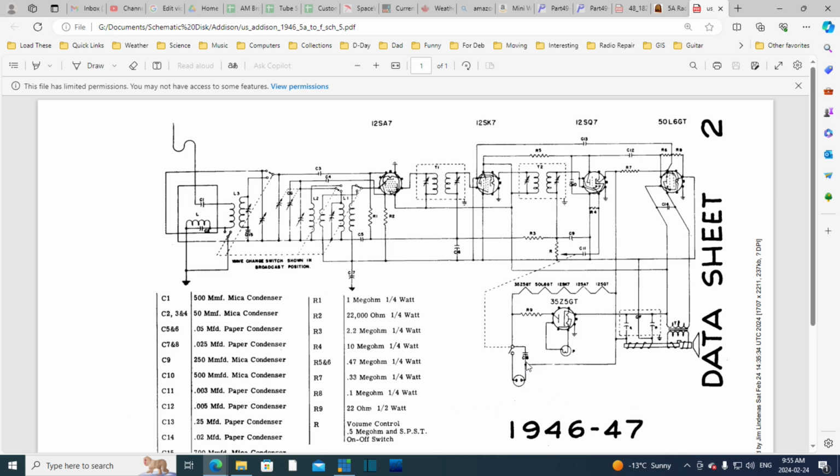Probably if you chase up here and here, and I don't know, sooner or later. And maybe if you switch the plug this way or that way, it'd be very, very dangerous. You'd have 120 volts sitting on a chassis. So to make it safer, they put a capacitor in here.